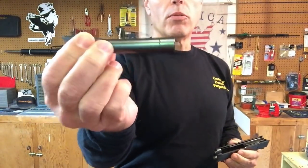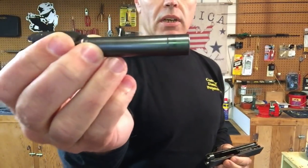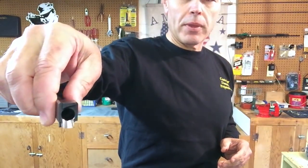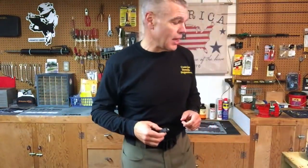You can also remove the barrel for cleaning. The stainless steel barrel is cold hammer forged for long barrel life. Everything about the 509 is intended to make it last a long time under adverse conditions — from the finish on the slide, to the cold hammer forged barrel, to the dual recoil spring. The barrel also comes from the factory with a polished feed ramp, which is a nice touch to improve functional reliability.